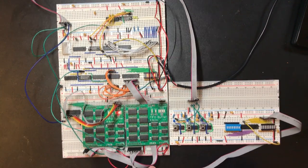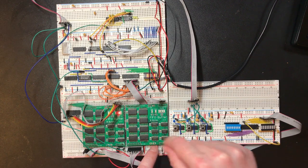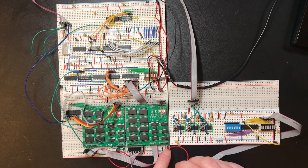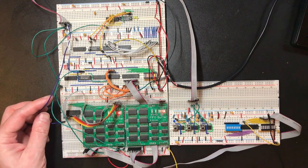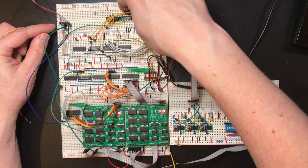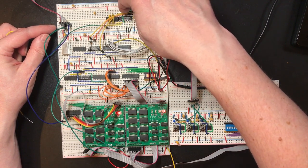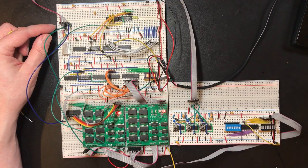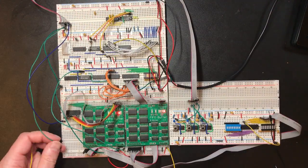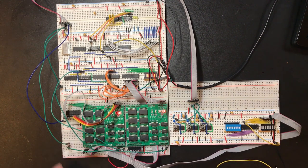Right, so if this button is the transmit, we want to wire it into the load here, which is that one. Now at the moment, the load line is going into this edge detection circuit, which then sets the transmit state on the set reset latch here. We're gonna have to rework that. I don't like switching colors on that line. That'll do.